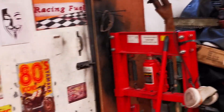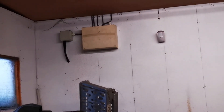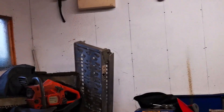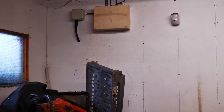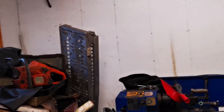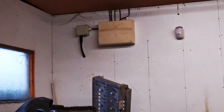The electricity in here is actually in a ring main, so it makes its way all the way around — all the sockets — and then returns back to the consumer unit. So we've got one ring main and a consumer unit in the house, then armoured cable from the house to this consumer unit, and then another ring main. That separates the house electrics from the shed electrics, so if anything wants to go wrong, both circuits are protected from each other.